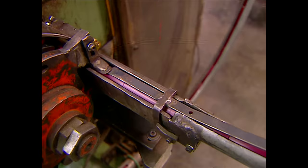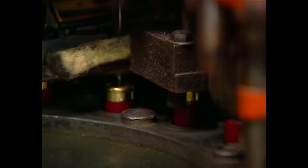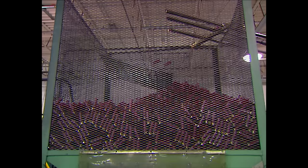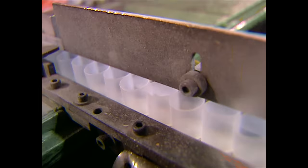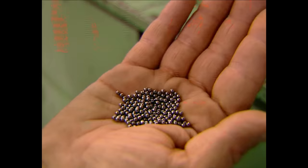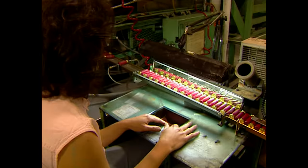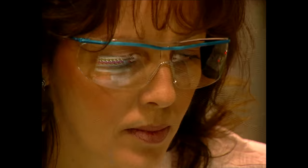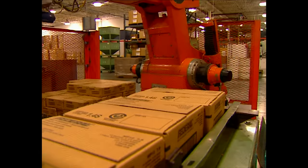And after the cutter, the hulls move out by conveyor tube to get the base wad that's wound and inserted in one quick stroke before moving to the header machine. This is a multi-operation turret press with hulls indexing through to get a brass cup and a primer, and then being crimped and formed in another stroke. Then it's the loader that looks much like the centerfire operation, but has turrets to load more elements, with the triple-plus wad column going in over the powder, and then the shot cup marching in to be inserted on top of that. Then comes shot, dropping in precisely measured quantities, then the crimp, and rolling past the inker to pick up a label.